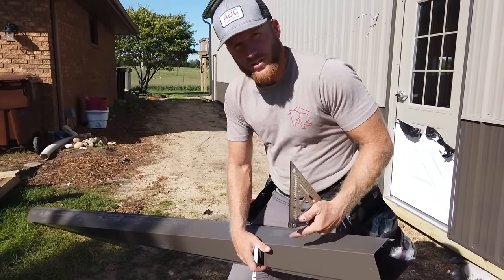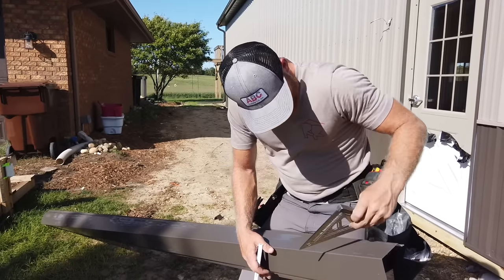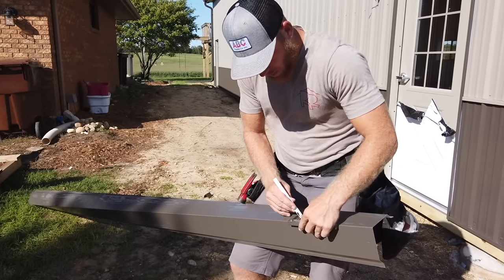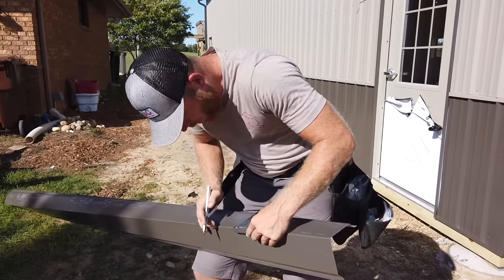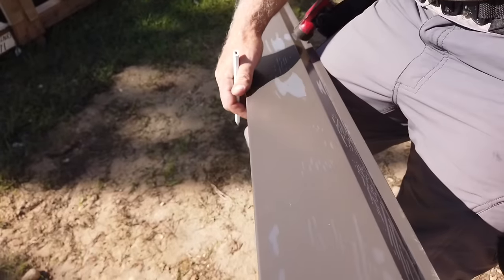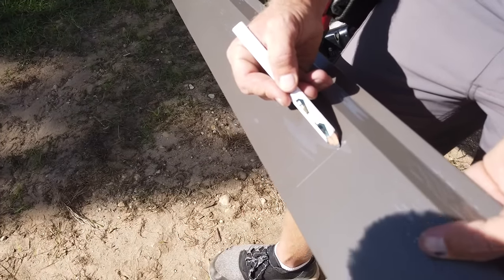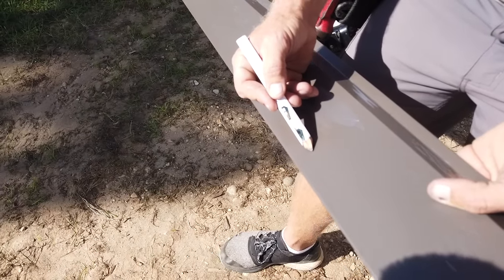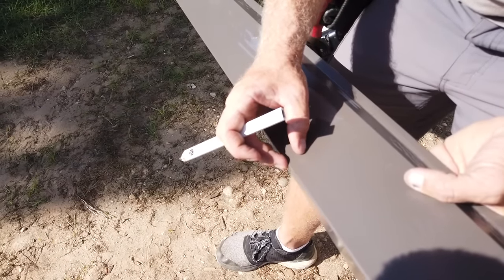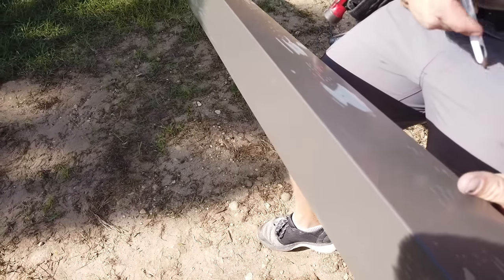This dimension could change based on the dimension of your trims, but we're a 7/8ths rib on our steel. So what I like to do — so it's not too tight — is make a 3/4 inch line down to my 112 mark and square it across, that 112 mark being my sidewall. So now we've got the 112 which is going to go up underneath of my sidewall soffit trim, then it's going to come up — this is that 3/4 mark — and it's going to come over to the pitch cut to the 116. Let's go ahead and cut it and then you'll see exactly what we just did.